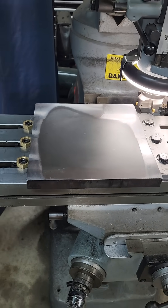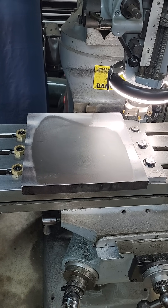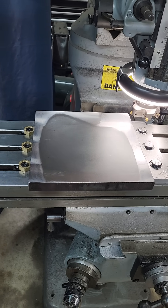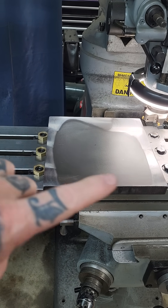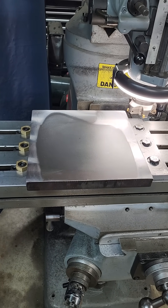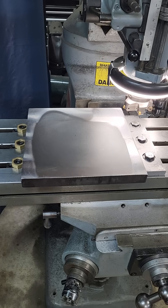After this I will pick up on the surface plate — we'll be dyeing the surface plate up and then transferring to see where the high spots are on this plate, to get an idea of how well the flatness is or isn't.